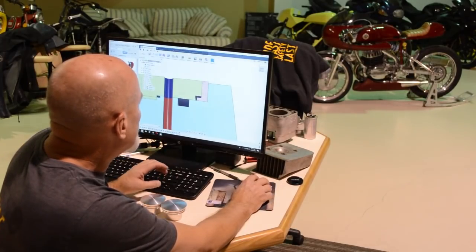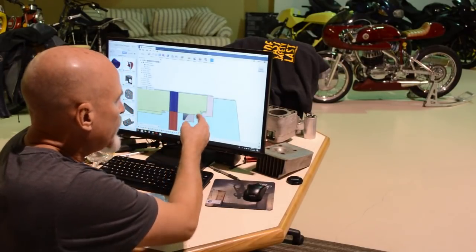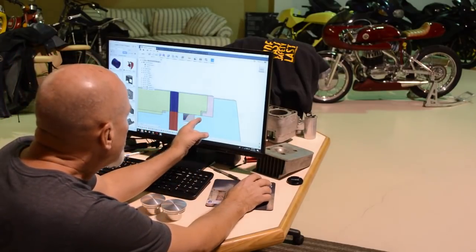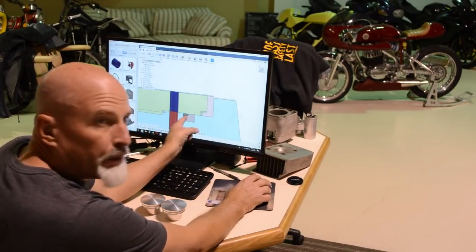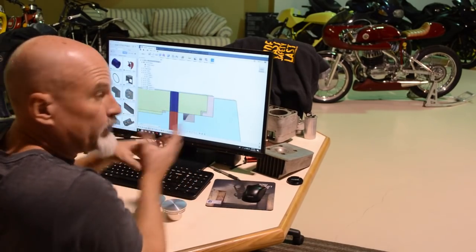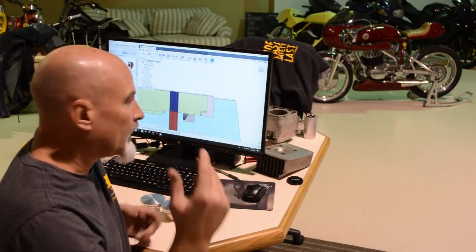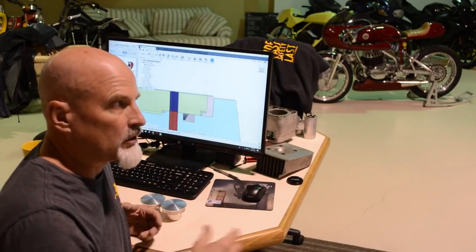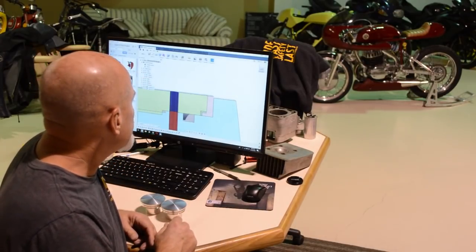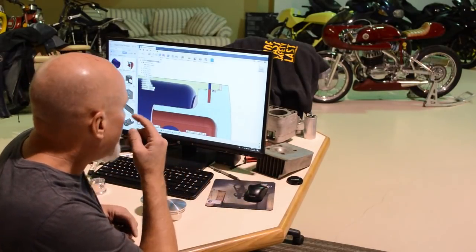What that'll do is this is the reverse dykes ring, which is a trapped ring, which will allow it to only expand so far. And then the purpose of the O-ring is combustion, of course, coming in behind the ring and expanding it. I don't want it shooting down through the threads — I want as much combustion behind the piston ring. I haven't really decided on how I'm going to pin it.